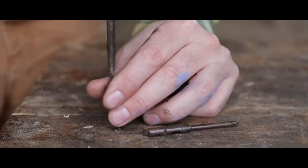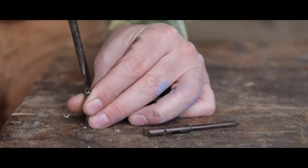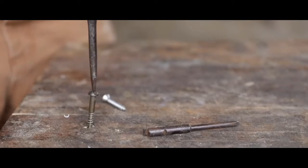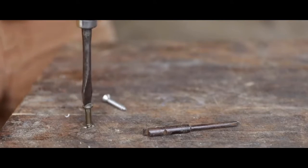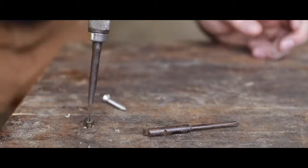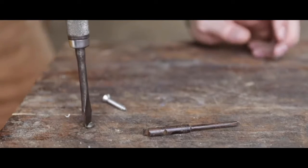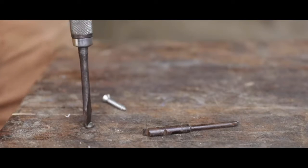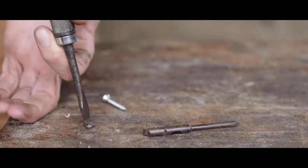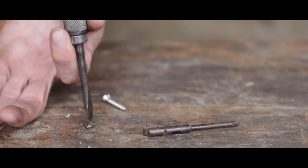If you don't pre-drill something — and let's say you do pre-drill it, bigger than it probably should be — yes it will work, but the chance of this thing misaligning and slipping off and marring your work... it's going to slip off and mar your work because you're putting so much pressure on it.